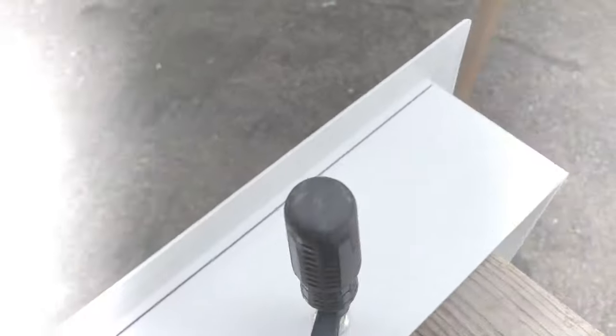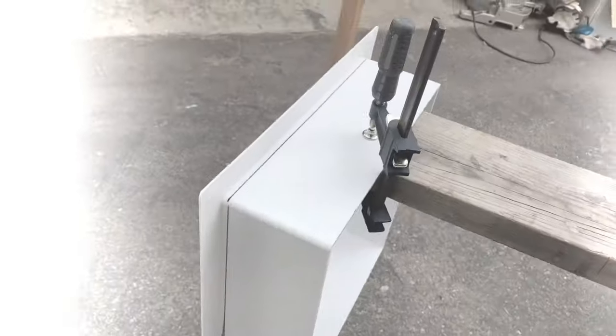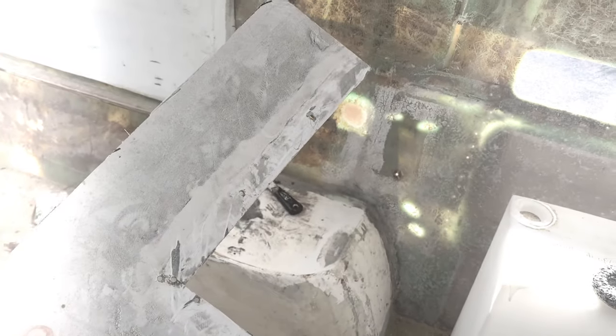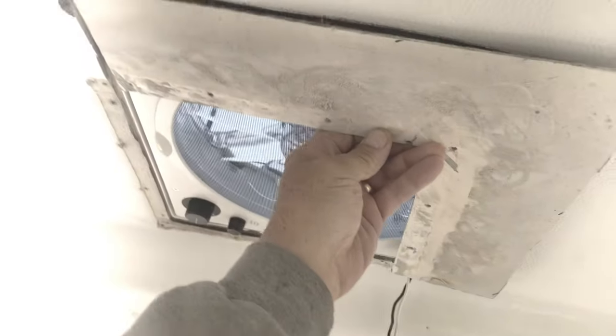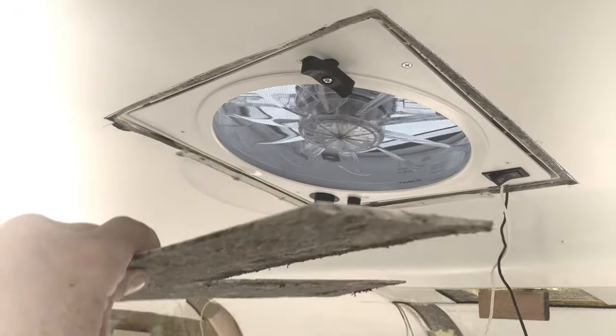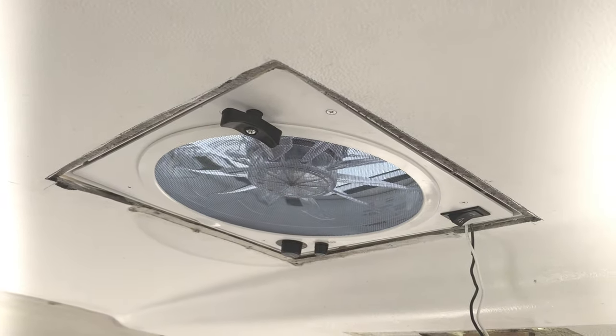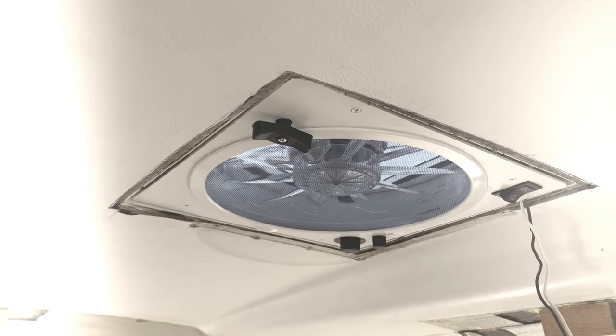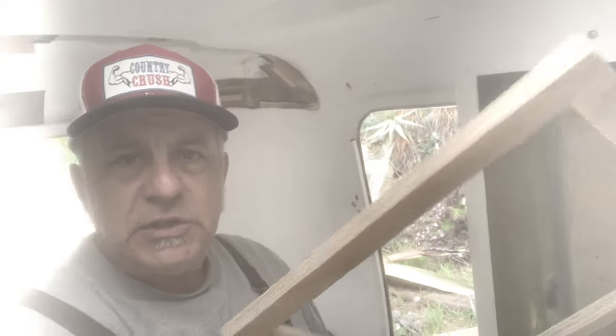I got this supported and I've marked it where it needs to be cut all the way around, so I'm going to go ahead and start cutting it with my little disc grinder. Here's the old piece that I cut out — this was the roof. You can see where the old vent was, and here's the fiberglass on the inside under the elephant skin. It looked kind of like this before — there was the old hole in the fiberglass, and now it's just this much bigger for the vent. It's only that thin, too — pretty thin stuff. It wasn't really that hard to cut. Maybe you could use a little saber saw or something, but that's just what I used. I went ahead and got a piece of plywood — it's exactly three quarters of an inch, leftover marine plywood from when I replaced my floor in the Scamp. I'm going to put this up on the roof and show you how it fits.